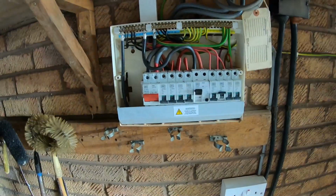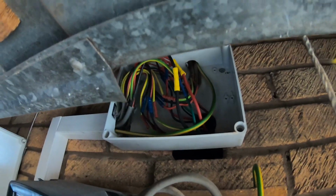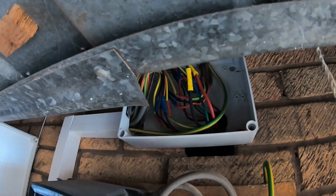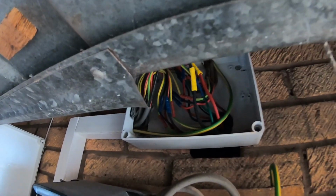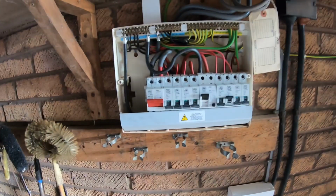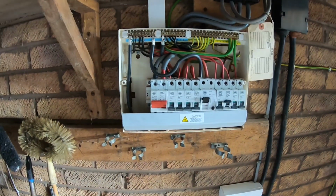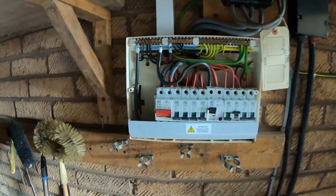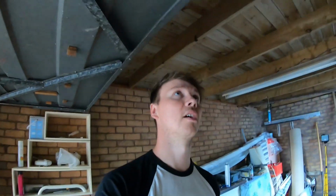I'm going to redo all the trunking, redo this connection box up here because it's all through crimps. Label it up, do it a bit neater. I might get one of them DIN rails that everyone was on about and crucified me for. The meter's being changed by the supplier and the cut out soon. So we're going to get that changed for a Hager 10-way split load, no SPD, not needed, not wanted. So that, I'm into the kitchen.